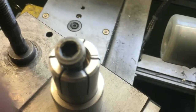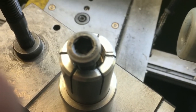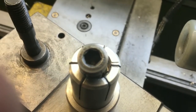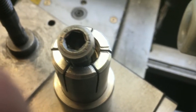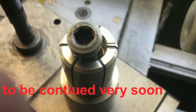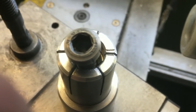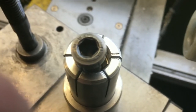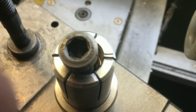It spreads them out to grip the component. The important thing is you don't want it spreading out miles and miles — it'd be no good if the OD of this is 22mm and the bore you're trying to hold is 23mm, because you wouldn't keep it concentric. The bore of the components going on this is 23mm, and this is just a running fit in that bore. The slightest expansion of the mandrel grips the component really solidly — no slip at all. I'll show you fitting it up and putting one of the components on the mandrel.